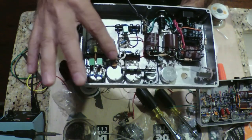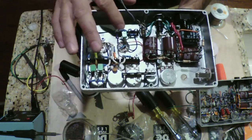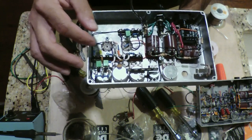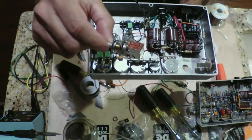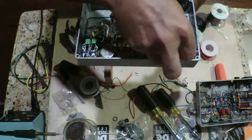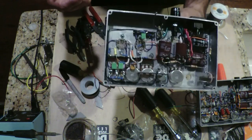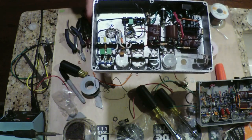We have our 470K resistors, our 500 puff bypass on the 470K heading into the cathode follower. Got our little lead right here for the heaters. So I think at this point it's time to get back to wiring and to start maybe even wiring up our Jose potentiometer, with all the goodies that it needs, and go ahead and throw that in. We can also go ahead and wire up the tone controls, and then we're pretty much getting close to the home stretch. We'll be able to demo this piece of gear through the Marshall and through the Ox, or through the 2 Notes Cab M.